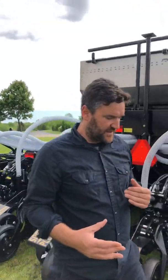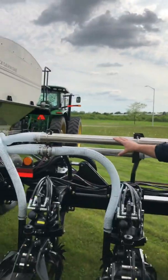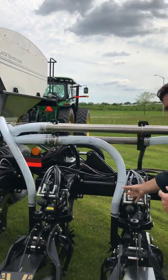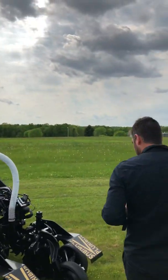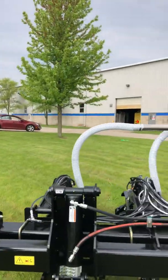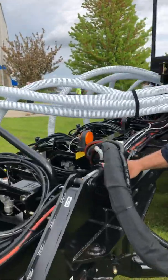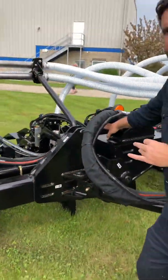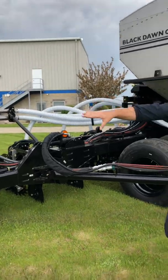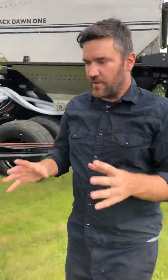Care has been taken to nicely integrate the routing of the dry fertilizer hoses — notice how these hoses come right out over the centerline of the row unit, coming straight down. That's one of those fit-and-finish things that matters a lot, because people know how much trouble can happen with fertilizer hoses. Importantly, this toolbar has integrated the adjustable wing weight transfer system, which allows you to keep constant weight all the way across the frame, evenly distributing weight to the row units across the entire bar.